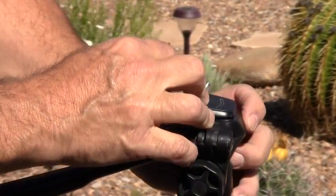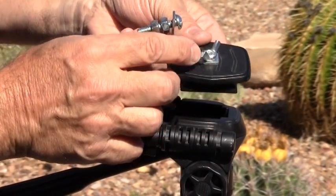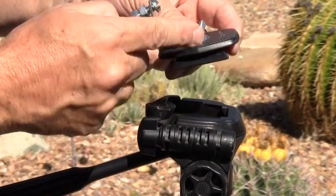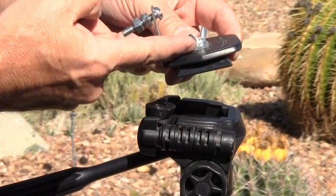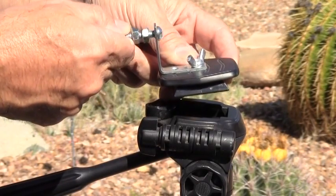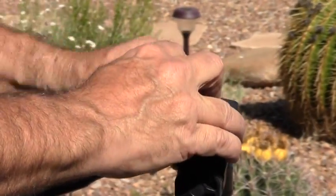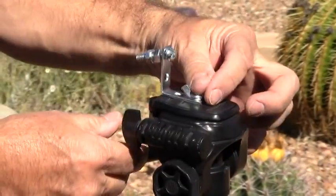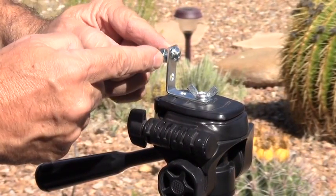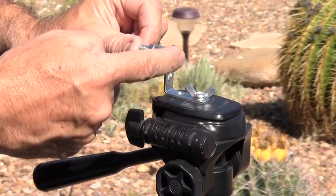The camera shoe — I'll be attaching the binocular to that with a quarter-twenty wingnut and a right-angle bracket. You might have to drill out the holes at the ends so that they can hold and pass through a quarter-twenty bolt. That slips in here, and that's firmly attached like that. Then this one-inch quarter-twenty bolt with two quarter-twenty nuts will attach the binocular to the foot.